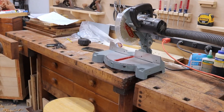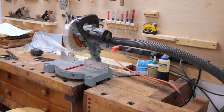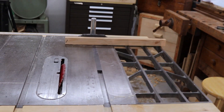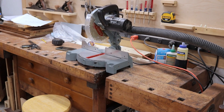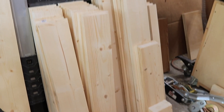This is one of those times I'm really grateful I have both a miter saw and a table saw for this project. I can leave the miter saw set at 90 degrees for all of those cuts, and leave the table saw set at that 63.6 degree cut. That means I can cut one end of all those angled pieces on the table saw and the other end at the miter saw. I got most of my pieces stacked and cut — now it's time to assemble.